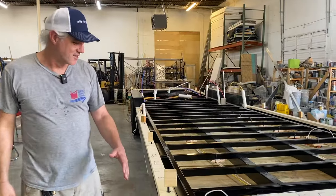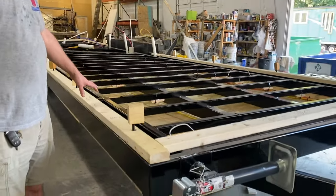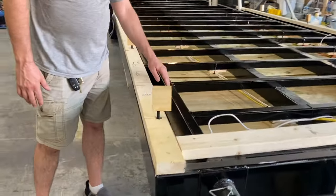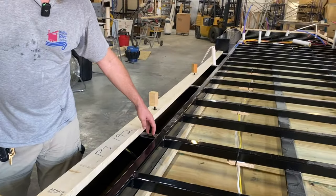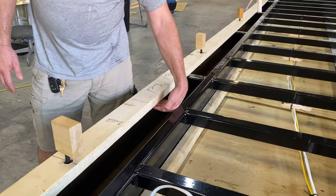All right. So the frame of the trailer is made with 6-inch by 2-inch by 1/4-inch rectangular tubing. And then on the edges, the rectangular tubing runs all the way down from front to end inside the fenders. And then outside the fenders, we have these outriggers, which can be insulated